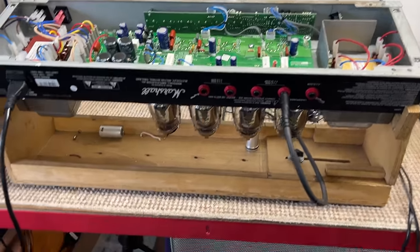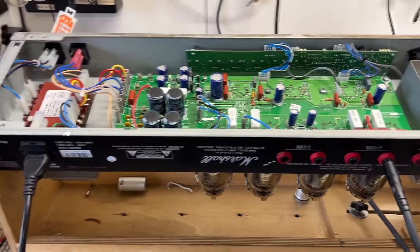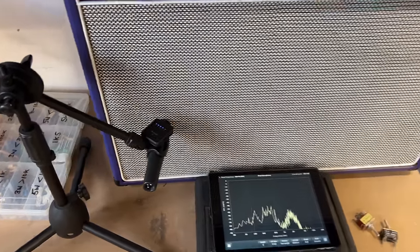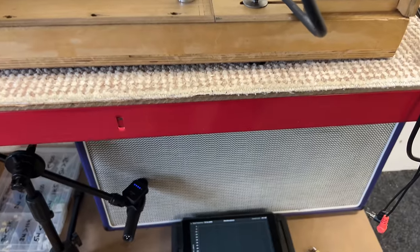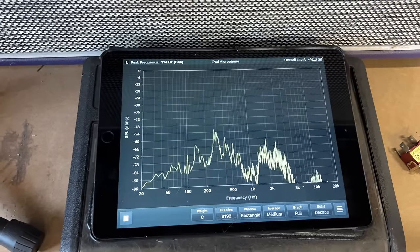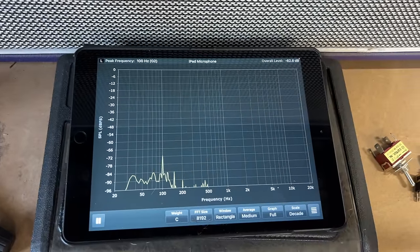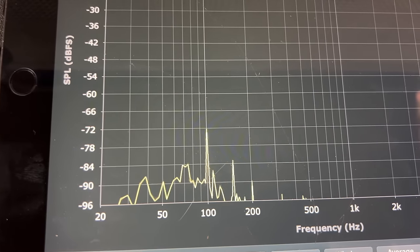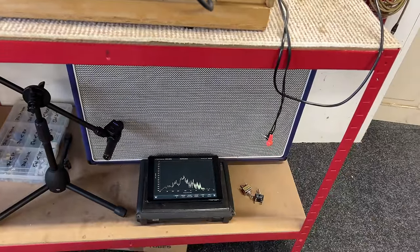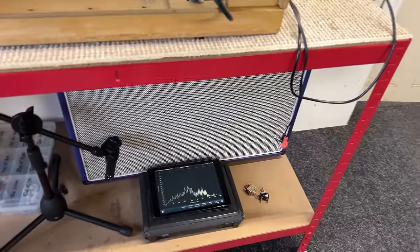Kerry King on the bench — I fired it up, running into 8 ohms. I've got another microphone on here so you should be able to hear any noise and hum. I've got the iPad on there — if I go really quiet you'll be able to see how much noise there is. There is a spike at 100 hertz, but it's at minus 72 dB, which is nothing. I can barely tell the amplifier is on — so there's definitely not a mains hum.